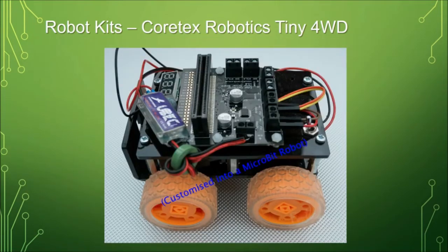I actually modified one of the kits and put a microbit motor controller board on it. Instead of a Raspberry Pi, I've got a microbit motor controller board — you plug a microbit in and kids can program it to control the motors using drag-and-drop coding. You can see I've got the U-BEC on there to give a safe 6-volt supply to the motor driver hat, which powers the microbit safely, and underneath I've got a couple of lithium cells giving me a 7.5 to 8-volt power source.